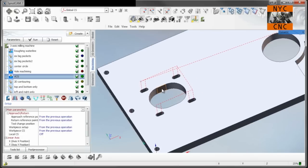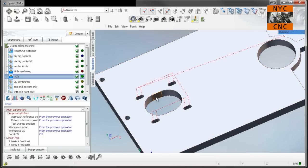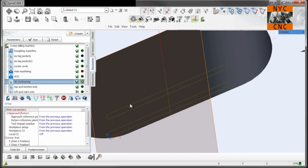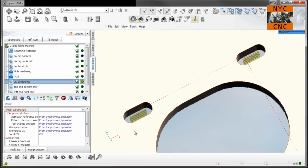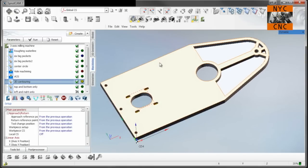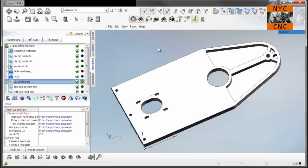It's one that I already have in a chuck, so I'm fine with that versus chucking up a dedicated drill to get closer to the 3/16 size. Then we'll come through and machine them with a 3/16 end mill, which will go quite quickly and should look nice. So that's the majority of the CAD. We're not going to end up machining these two little pockets right here. They aren't necessary given how small they are and the requisite fillets.